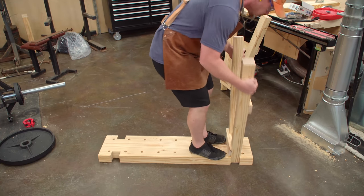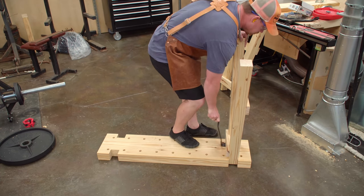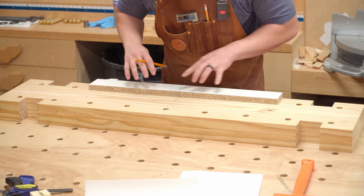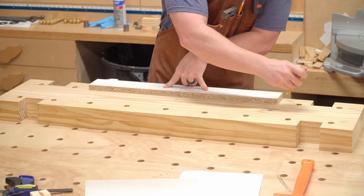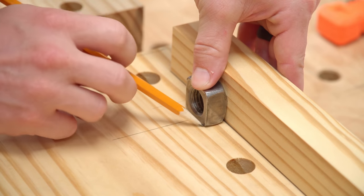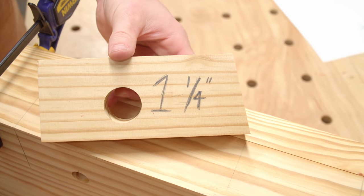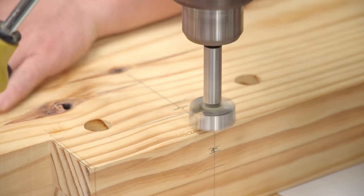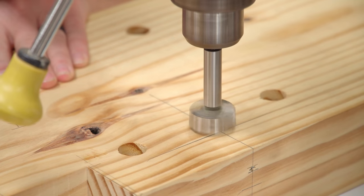Now that the structure is done I can take it apart and work on more details. As it turns out the leg to top joints were a bit too tight — I had to use a pry bar to remove one of them. To be more consistent in the front vise hardware locations I made a simple storyboard with a marked center line and cut to the exact length between the centers of the vise screws. A board will be glued to the bottom to build up the stationary side of the vise, but first the nut mortise needs to be cut. One really nice thing about a square nut is that it will not rotate in a round hole as much as a hex nut, and a 1-1/4 inch hole captures the nut quite well — meaning a drill press can be used to drill the mortise rather than using a router or chisels.